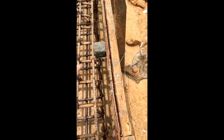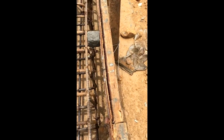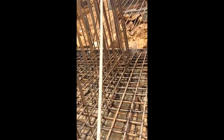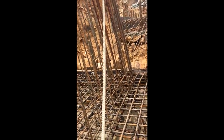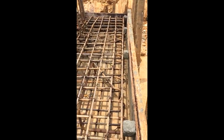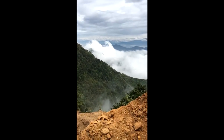That is a 50 mm cover block, and this is the formwork. You have to maintain a gap of 50 mm between the rebar and the formwork. These are the shear wall rebars as shown earlier, and they have their own development length. Hope this video was helpful — if it was, hit like and subscribe for more videos.